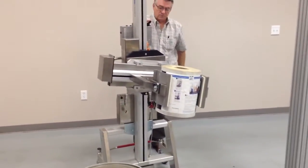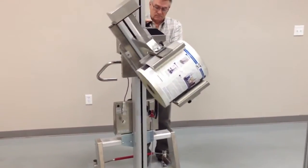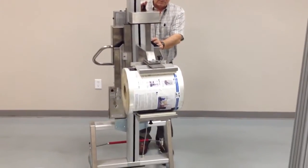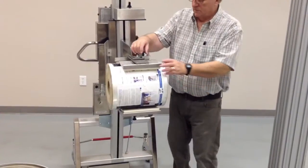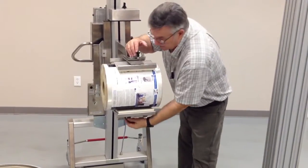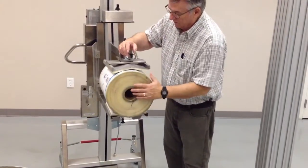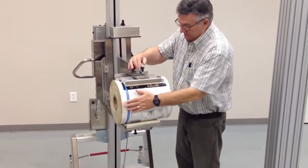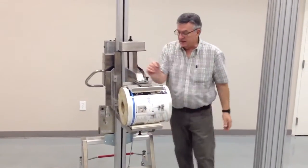You can now rotate the roll and get your position. Once it's in position, release the plunger pins. You can now rotate the roll for spindle loading or wind orientation by swinging it all the way around. Latch the pins back in again.